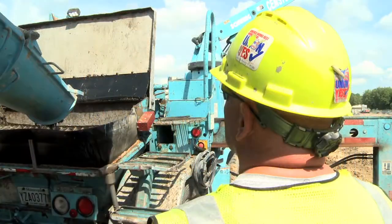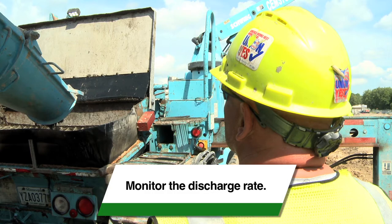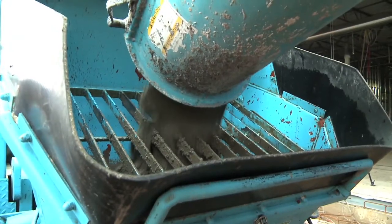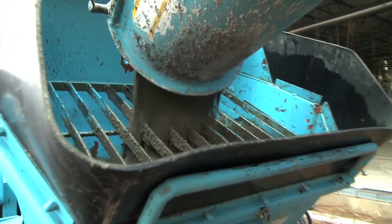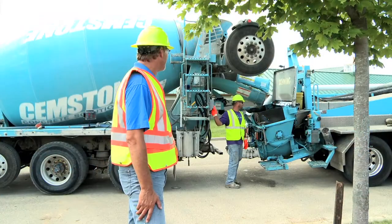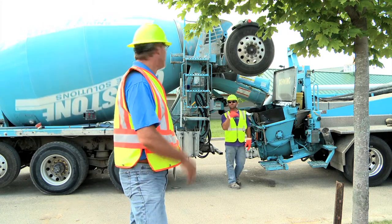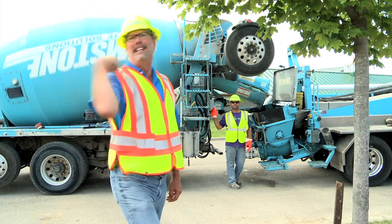The second task is to monitor your truck's concrete discharge rate. Your concrete shouldn't discharge too fast, causing pump hopper overflow, nor should it discharge too slowly, causing insufficient concrete into the hopper. If you can't keep pace with the required discharge rate set by the operator or his assistant, let them know immediately.